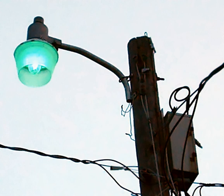There are also self-ballasted mercury vapor lamps available. These lamps use a tungsten filament in series with the arc tube both to act as a resistive ballast and add full spectrum light to that of the arc tube. Self-ballasted mercury vapor lamps can be screwed into a standard incandescent light socket supplied with the proper voltage.